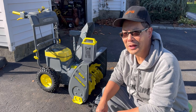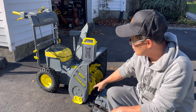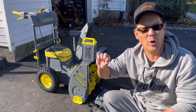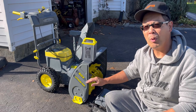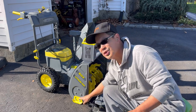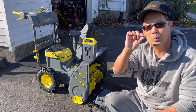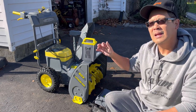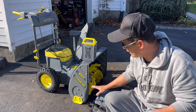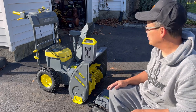Okay, isn't that much cleaner now? I used some of my power tools to get it done quicker. To put on the snowshoes, you'd have to put like a little screwdriver on the very bottom, or maybe a couple of coins, just to lift the scraper bar off the ground just a little bit, less than 2 millimeters, and then tighten the bolts to where your snowshoes are optimal for your driveway. Because it's paved, you only need very little room for the scraper bar. If you have a granular or rocky driveway, you would want to raise the bucket higher, so you would loosen those two bolts on the snowshoes and lift it higher. You'll see what I mean.